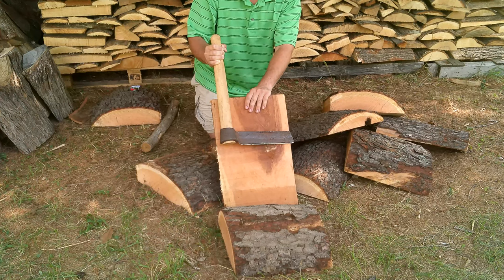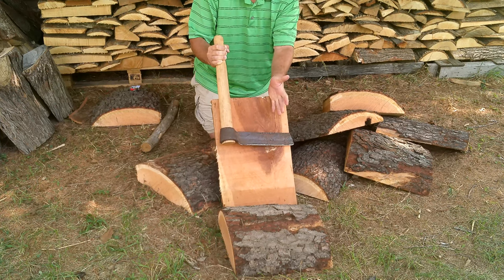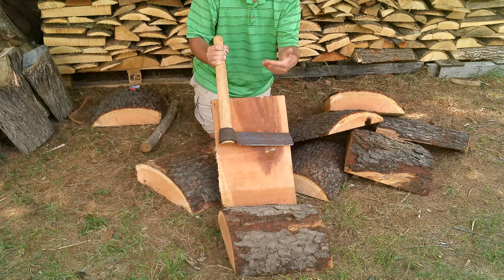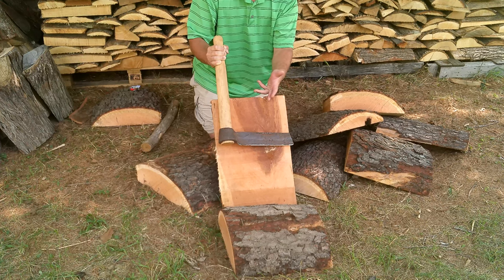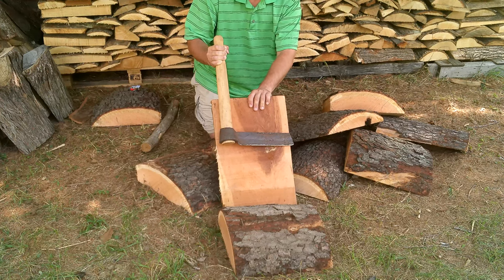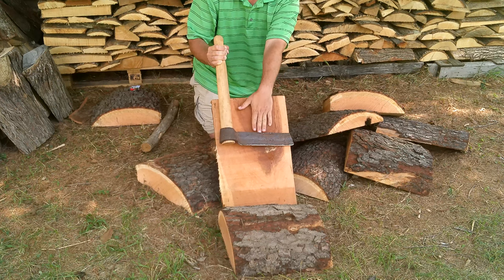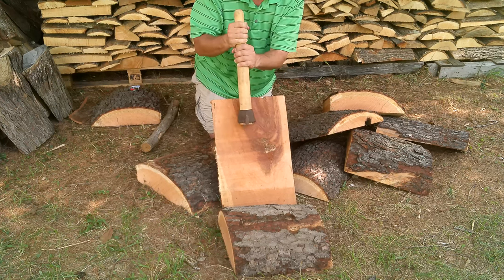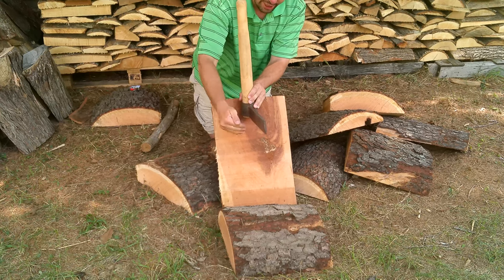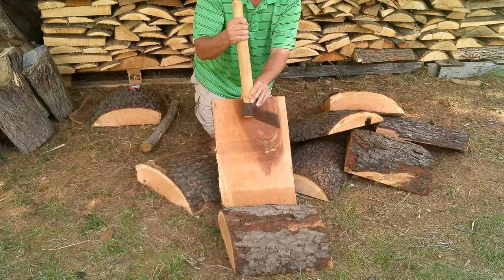This cherry is a little harder to come by and a bit more expensive. If I mess up a piece and have to go buy cherry as sawn cherry, that's going to be a dollar a board foot. I want to make sure I get enough pieces out of this little pile to complete my project, so I'm going to use the more precise tool. The fro is a wedge on a handle — you pound the wedge in, then twist the handle, and you can get a very controlled split.